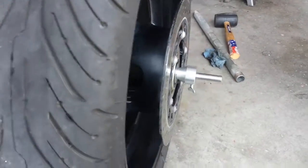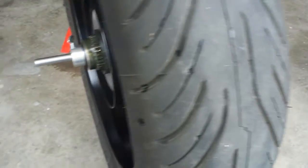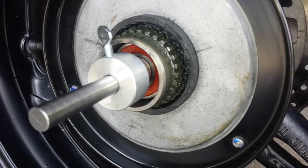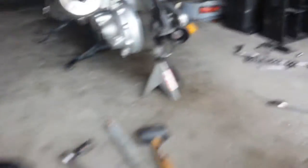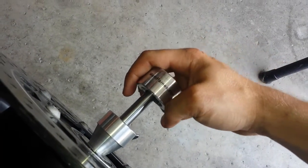What I've done here is centered the cones on the bearings of the wheel, and I've got the wing screws tightened down — 180 degrees opposed from each other. Here's the cone going into the drive side of the wheel, into the bearing, and same thing on the other side. You can see the cones: that one's down and this one is up, so they should offset each other on the balance. The shaft is as centered as my eyeball can make it. Now I'm going to slide on the bearings and the cap so they don't fall off, and do that on the other side.